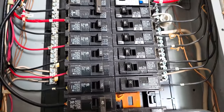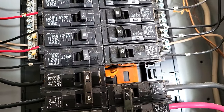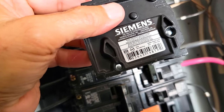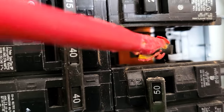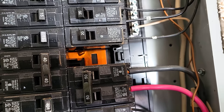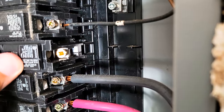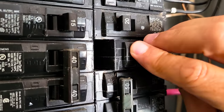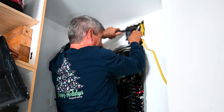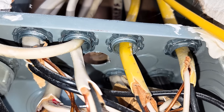There are other considerations, like where do you want to put your breaker. We discovered it's okay to fill in this spot, and we'll have to punch out the little plate on the front cover — that's a good place to put it with all of the other lighting. The breaker has a hook that hooks right under this plastic tab where you're going to put the breaker in. Once you hook it in, you snap it into place on the bus bar. We slide the breaker into place, make sure the hook is underneath, give it a little push and snap it into place. Then punch out that blank — there's our hole. We'll run the wire through there.